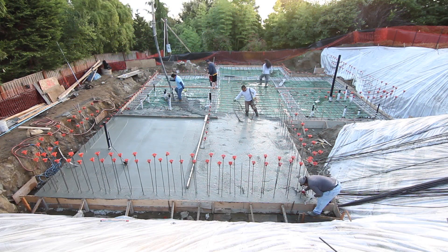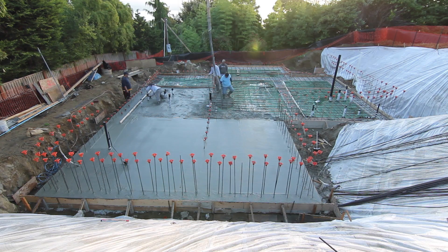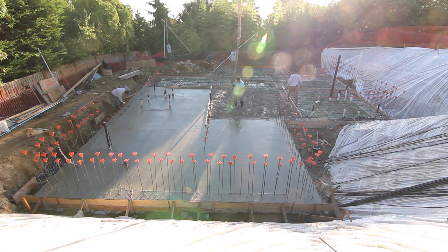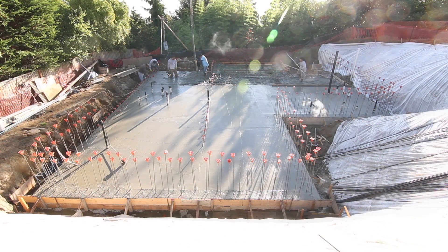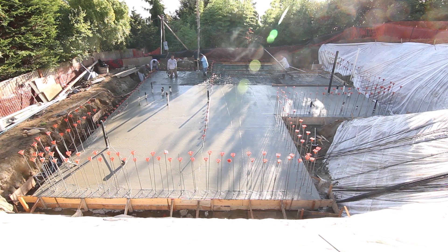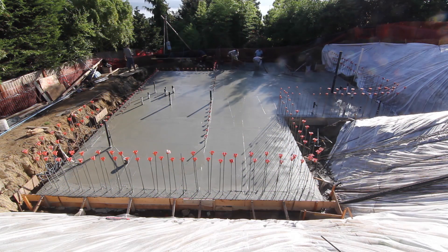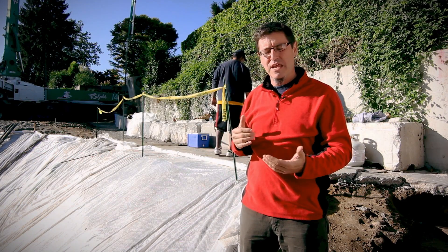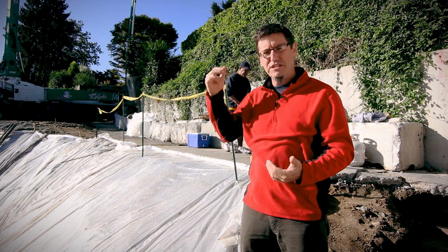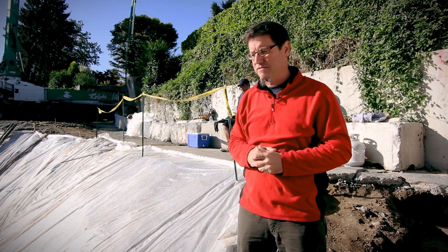This platform we have here — we can now build on top of it. On top of this structural slab, we're going to put five and a half inches of foam, and there's going to be a structural retaining wall zigzagging on the backside of the hill. We're going to insulate on the inside of that, so we're building our thermal envelope inside the structure that is connecting this building to the soils. It has created a few unique structural details throughout the building, which we'll be seeing in the framing phases and later at the insulation phases.